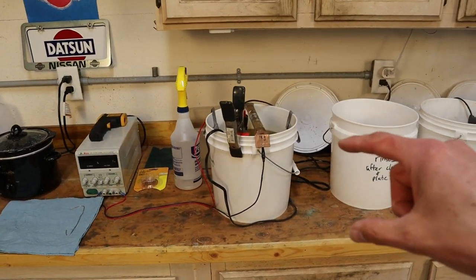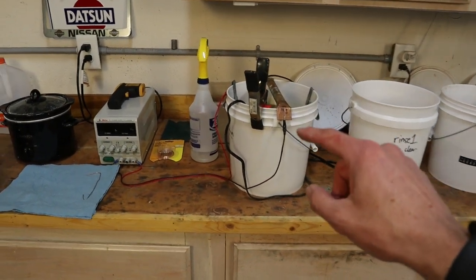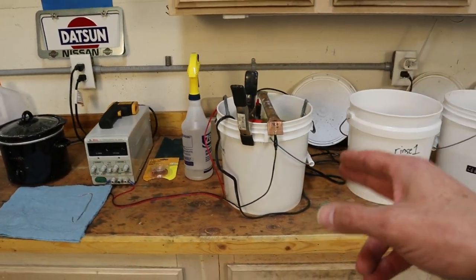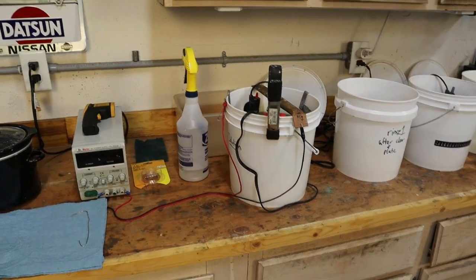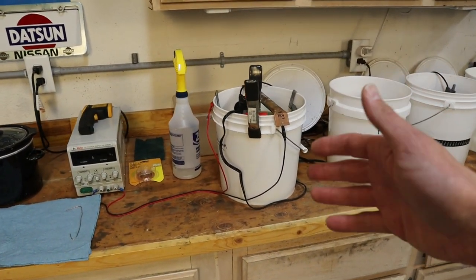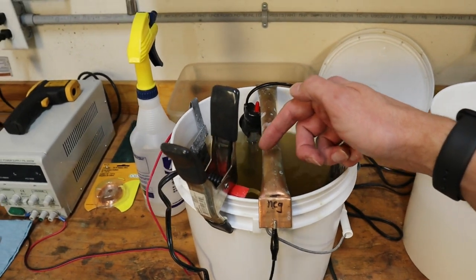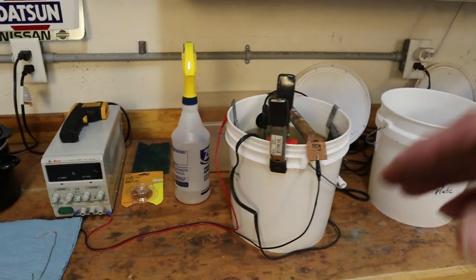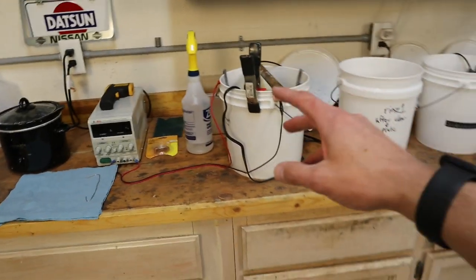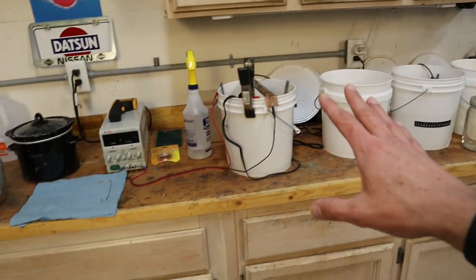When buying your buckets for the acid bath, go ahead and buy at least four more for a total of five. I use Caswell's kit — I'll put a link and all these items in the description below. It's around $250 for the kit and you get the solution, zinc plates, a pump filter, and brightener. You can also buy the yellow chromate from them, which I totally suggest. I tried doing this from scratch, buying zinc ingots and trying to build it — it's a pain. Just buy the kit. Trust me.